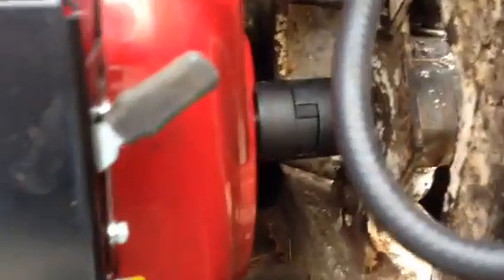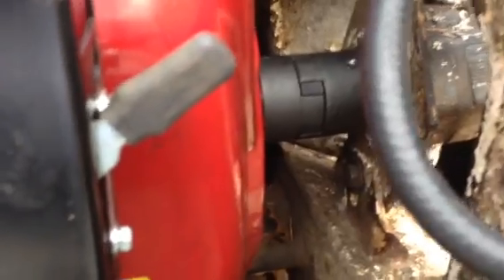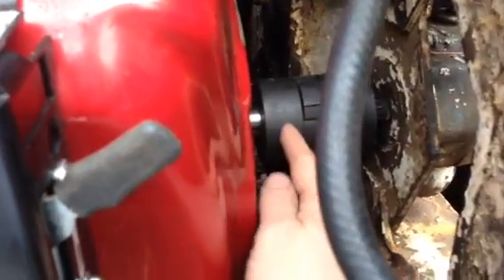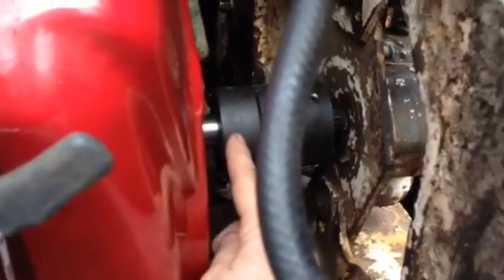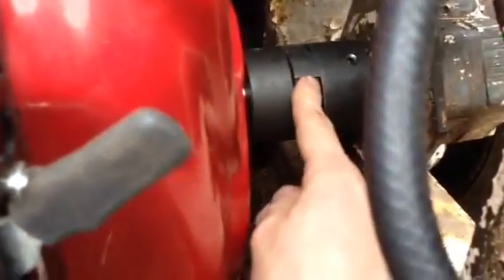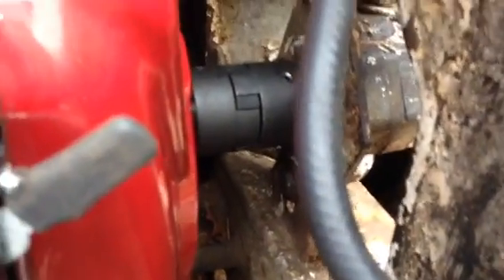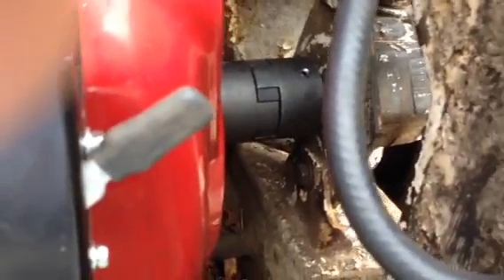As far as powering the hydraulic pump, I have over here a Lovejoy-type coupling — it's not Lovejoy brand. This is a jaw coupling, Lovejoy type. There's one jaw coupling side which attaches to the stub shaft adapter — and I have part numbers for everything written down on my notes page — a rubber star in the middle, and then another jaw which attaches to the hydraulic pump. And that powers the hydraulic pump.